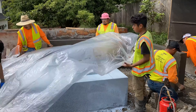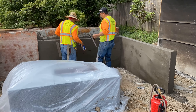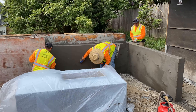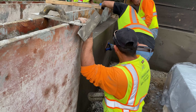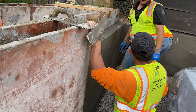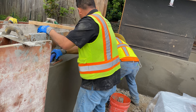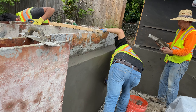We just have to work it with our hand float. Another technique we use is to cover areas like the fire pit with plastic. Covering it with plastic encloses the concrete area, causing it to almost sweat a little bit. That helps with the process so that when we come back the next day to pressure wash it, it gives us a nice sand finish look.